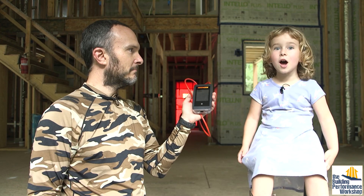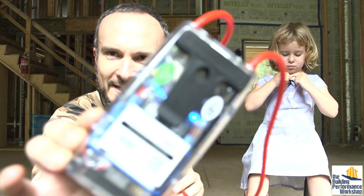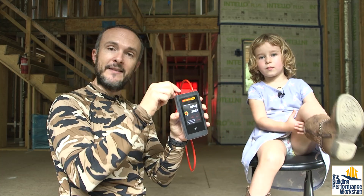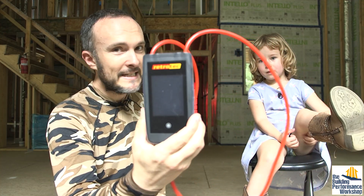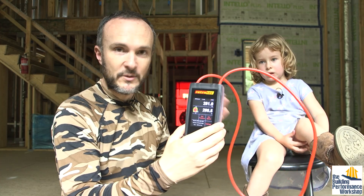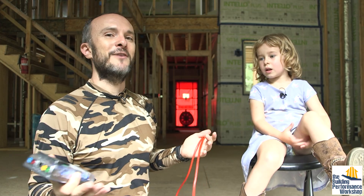What's this called? Manometer. Exactly. So this is the pressure gauge. This is the fresh one we just got from RetroTech — it's cool because it has a clear back. Your hoses are your weakest link. You want to plug in all of the hoses you're about to use into the input side of both channels A and B, and make sure the number that shows up does not drop precipitously to zero. If it hovers around 300 pascals, great — that tells you your hose does not have holes in it. If it does, your test is wrong and you wouldn't know it.